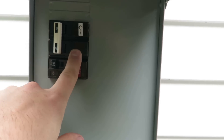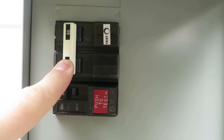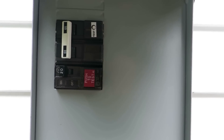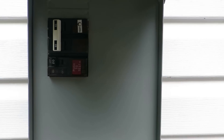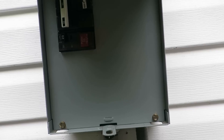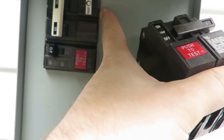For a hot springs hot tub, this setup here is not ideal. This is a 60 amp — and as you could tell inside my house, I was only running a 60 amp double pole. So I have a 60 here and a 20 here — that's 80. That means this is more than the service from the breaker feeding it in the house, so this is going to never trip. Basically the one in the house will trip before this one does. You're still protected by your GFCI, but the 60 amp here is essentially doing nothing. The ratings on these breakers protect the wires going to the location — so in this case, protecting the hot tub. The 60 amp is overkill, so I went out and bought a 30 amp, which is the correct one rated for this hot tub.